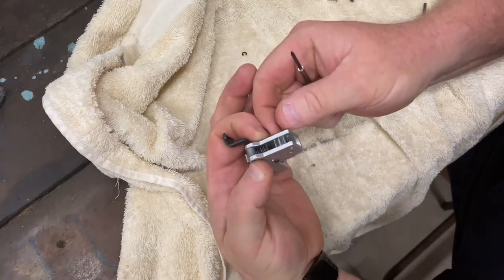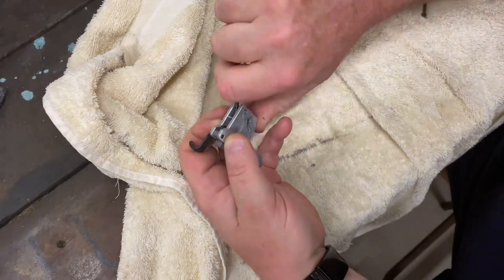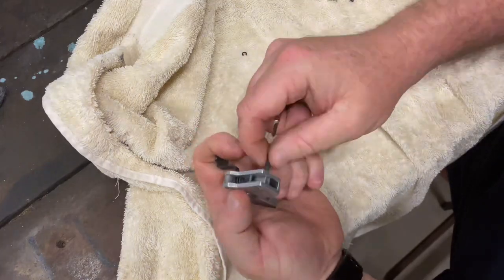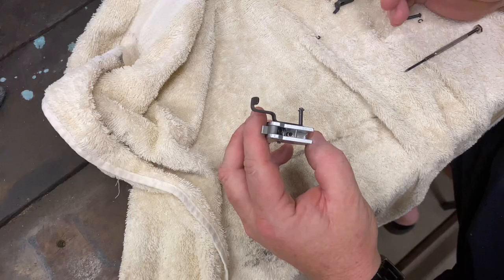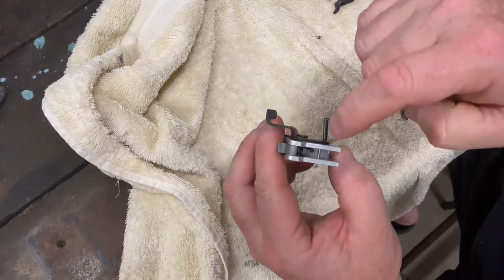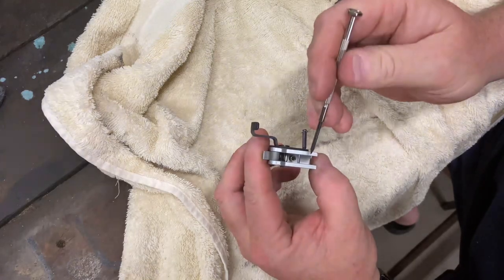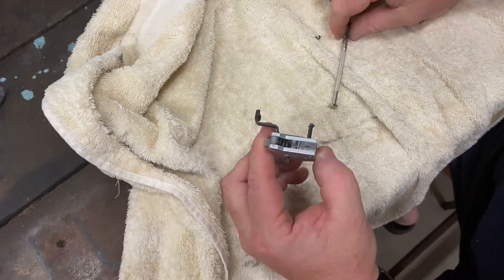Okay, now I've pushed that through there a bit. Okay, here he goes. Now, I've knocked it out, see? Sometimes these things just will not play the game. Right, springs in. Now we've got to get the sear underneath that little bar, fat fingers out of it, there and down into there with that hook